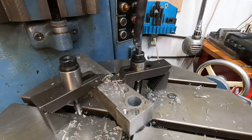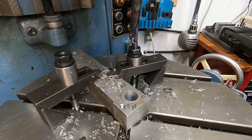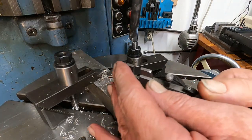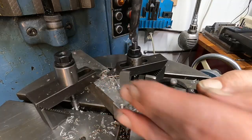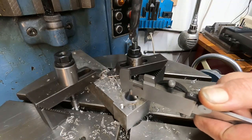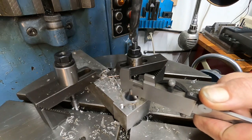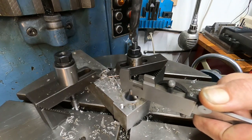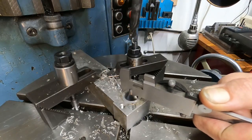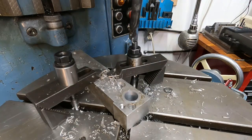I just kind of want to get an idea of this collar's accuracy. I'm not going to do anything fancy — I'm just going to stick a caliper in there. Oh — I'm hitting numbers pretty good doing what I'm doing. That reads seven-oh-five — .705.